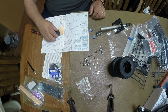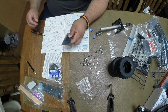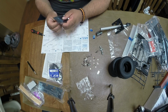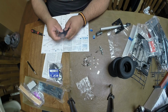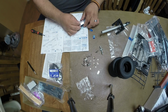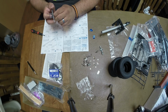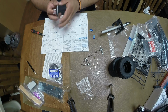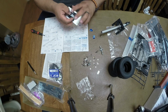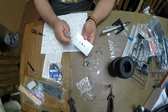And then our last step for step 4 is to go ahead and build our Kingpin setup. It's going to take your basic Kingpin plate. It's going to take 3 M8s. They go through this metal bracket, which is in your parts bag, through the plastic, through the Kingpin, and then into a flange nut. These are one of the ones that automatically lock, so they're really handy. So you use 2 of your M8s on the outsides with 2 flange nuts, like so. So you end up like something like that.